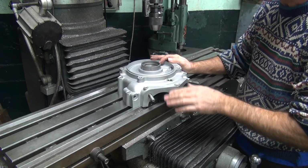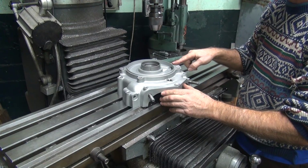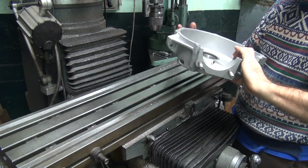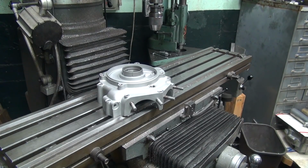All right. So we get in the spot face. Got 4 helicoils there, 5th helicoil there. So this case is done. So we're ready to put the bearing on this one, in the other case.